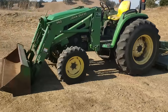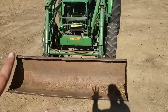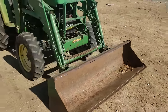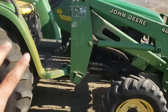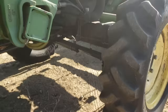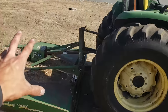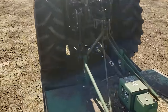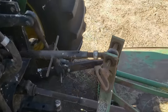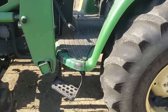I always start with a walk-around of the tractor. Most of these tractors are either two or four-wheel drive — it really depends on the front. This is the loader, used to scoop dirt, lift equipment, basically whatever you need. This particular model is four-wheel drive; you can tell by the geared hubs by the front tires. On the back you have your accessory options — most of these tractors utilize a three-point hookup system with a drive shaft in the center: one, two, and three hookup spots. The drive shaft is powered by the hydraulics of the tractor.